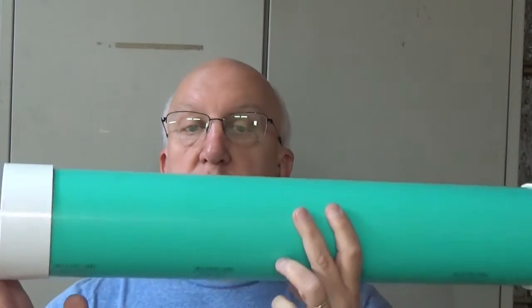We need to suck the air out of the wood. The wood is very porous, especially a brittle piece like we have here. I made a vacuum chamber out of PVC pipe — you can buy them of course. It's a two-foot piece, solid end glued on one end, open on the other. I have a ring cut to fit over the end so my plexiglass can seal on that. I'll put gasket material between the two, and when suction is applied it'll suck the lid down tight while it sucks the air out of the wood.